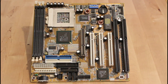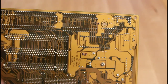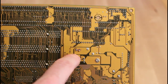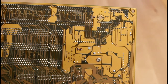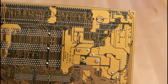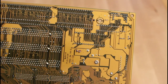Let's take a look at those capacitors first since that is obviously a problem. On the other side of the board, the two capacitors are this one here — which you can probably see wobbling — and this one. There is some visible solder rework on the board, and this one actually has a single pad all the way around. Obviously this capacitor shouldn't be soldered on this side of the board, because that would just be shorting across itself. I think someone tried to recap this board, didn't realize this, gave up, and threw it away. Their loss is hopefully our gain.